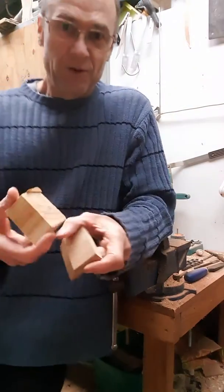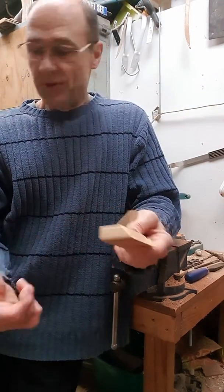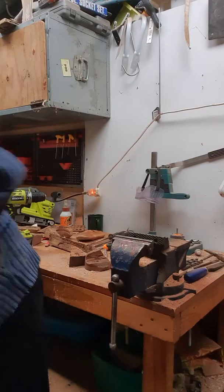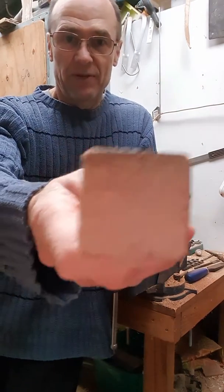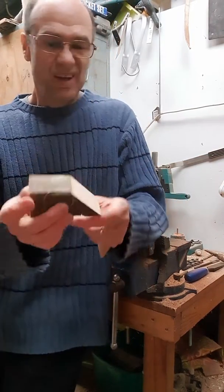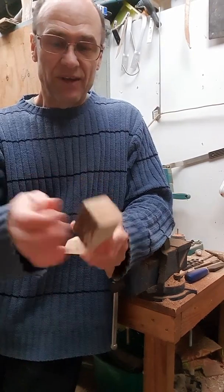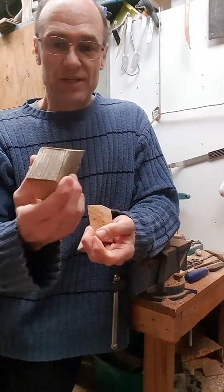How about playing with cypress pine? You can say I don't love it. It is a softwood, and as such, not really great. Very similar with Oregon. Oregon pickets we had sitting around at home that we replaced a while ago, some of them started to go rotten. Really wide grain, really not tough. You stand on the edge, it breaks away, you tend to overscrew it, it snaps. Really hard to shape because it doesn't hold together really well.